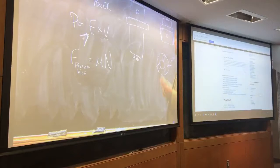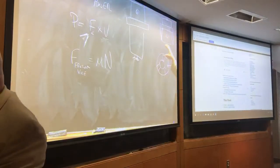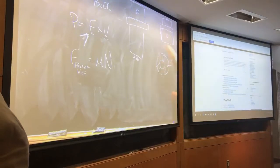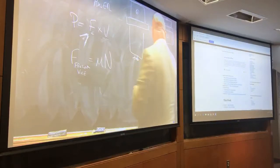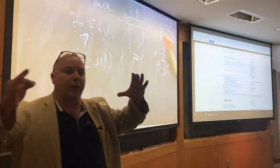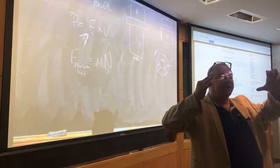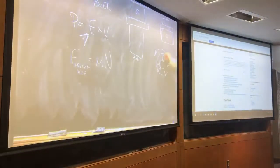It doesn't make that much difference if it's 2 here or 3 here. The real problem is that in order to do the cutting operation, that chuck is spinning, right? So the chuck is spinning, which means these pieces of steel that we're squeezing together with hydraulic pressure at a constant pressure are accelerating. In what direction are they accelerating? They're accelerating in this direction all the time, right?